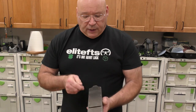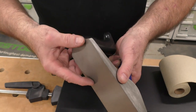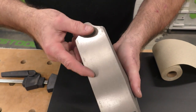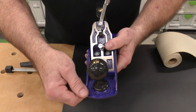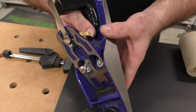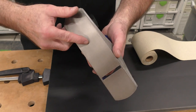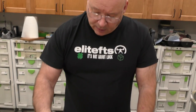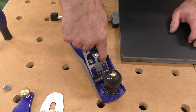The first thing I'm going to do is grind the sole and the sides — make this nice for Big D. I'm feeling here and here: this is not bad, but back here I'm going to file it ever so slightly. Right here they painted the surface — sometimes I'll grind that down. We'll also work on the frog; I'll show you how to check the frog to make sure it's milled flat, because that's very important.